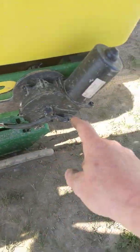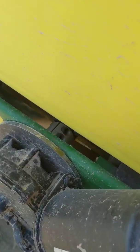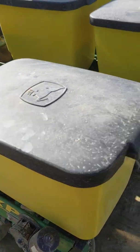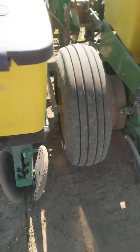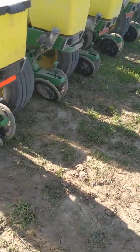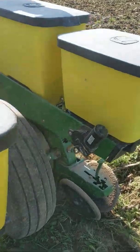These lines come out to the backs of the rows and these small motors are then controlling the meters. We had to build our own coupler that would fit into the John Deere drive and allow for positive control. The system then had to be calibrated using Graham's calibration tool for their corn planters to get the right motor speed and dial in the right flow rate so that we could get exactly two pounds per acre of the product we're using.